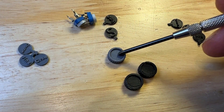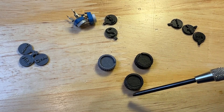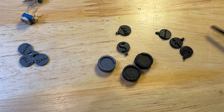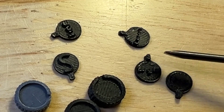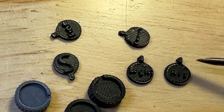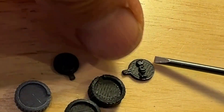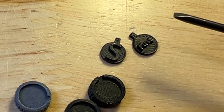The last thing I want to show you is this version — it has a depression inside and a slot. These were meant to be knobs that can accept a 3D printed label. I initially printed off a whole bunch and some of them didn't work. Because of the resolution and my 0.4 millimeter nozzle, those didn't work out so well. Some of them did sort of work — this one says 'fine,' this one just has a single letter S for maybe sensitivity.